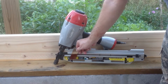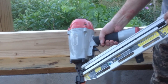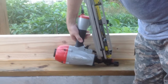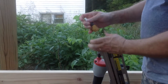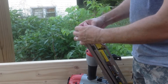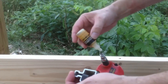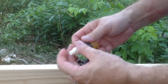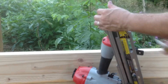Every nail has a degree setting when you're using a pneumatic nailer, but it's already been set. Every time you start to use a pneumatic tool, it's always good to oil it. As you can see, it says right here: oil daily. I'm about out of oil but I've got a little bit left. On the insert for the air intake, you just drop a couple drops down inside and that'll oil it up pretty well. The air moves it through the system. You don't want it running dry, so oil it every time you use it.